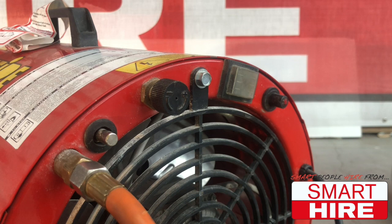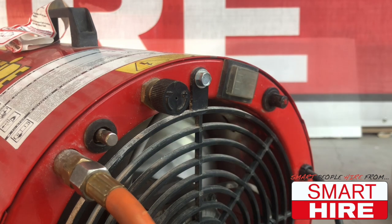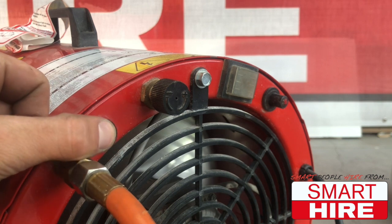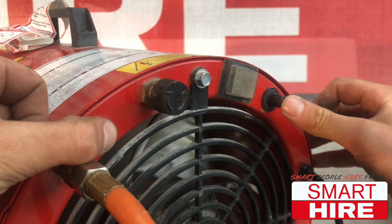Fourth, now that everything is fitted together and the heater is in position, turn on the on-off switch to start the fan. Then hold down the priming button for at least 10 seconds until the heater emits a slight hissing noise. Then click the ignition button 5 times or until the ignition is lit.